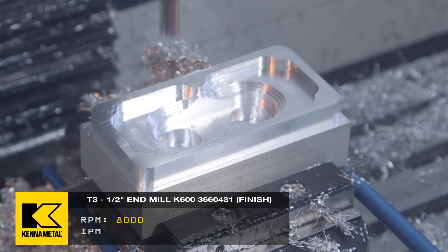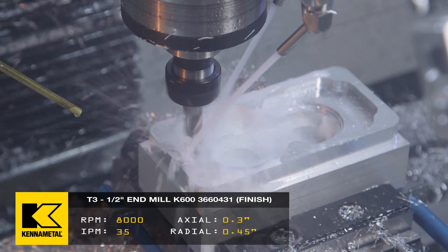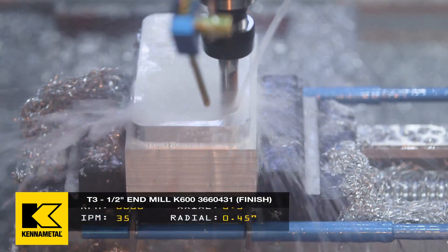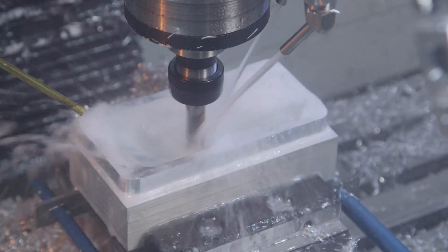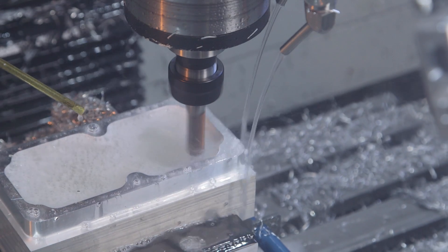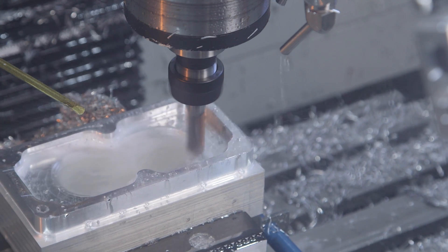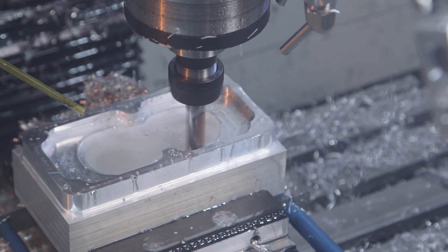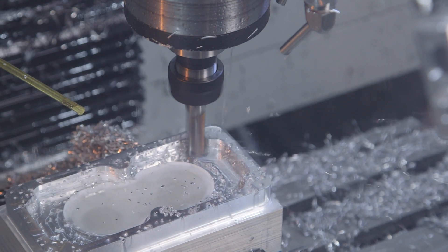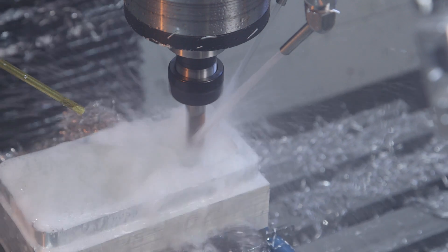So now we've just roughed everything out. We're going to bring in our T3, our half-inch bull mill. This is now going to come down and kiss that top wall, hit the floor, make everything look beautiful. I can listen to this tool — I can just tell it's making beautiful cuts right now. Back when we had that rougher come in and we were hogging out material, I didn't care about surface finish because I knew I left extra stock on all of my surfaces. So when I come back and bring in my finisher, it's just going to kiss the floor, kiss the wall — it'll be beautiful. It sounds perfect. We're not taking big chip loads, five thou everywhere, it's going to look great.